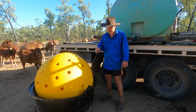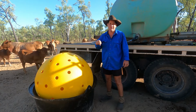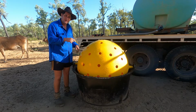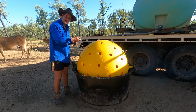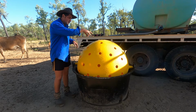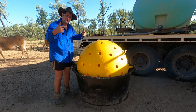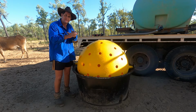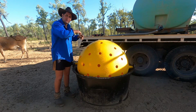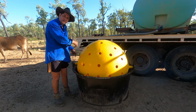Okay, now the first thing we're going to do is get that axle out and then re-drill out the hole that the pin goes through and sort that out first. What makes this job really difficult is there's a PVC sleeve that sits over the axle, and that's so that the ball rubs on the PVC rather than on the steel, so then that makes the ball last longer. So I've got to pull the ball off first and then we'll have to get the axle out of this side wing.